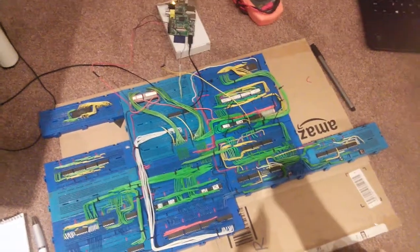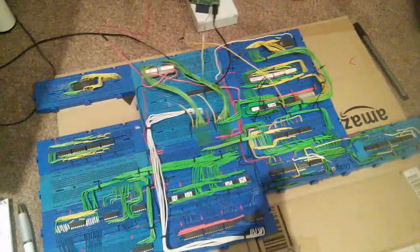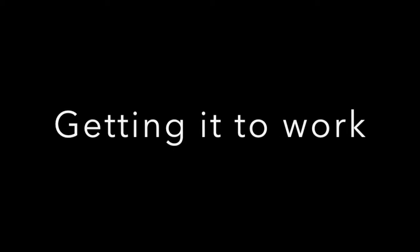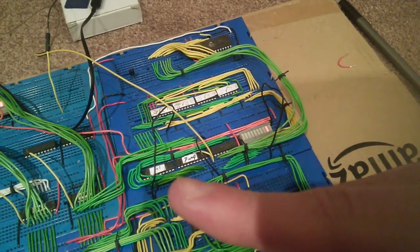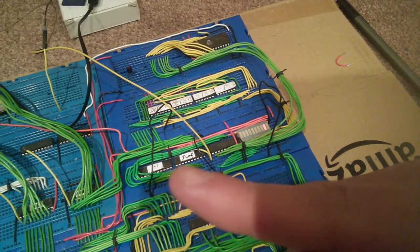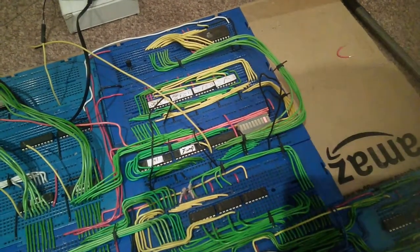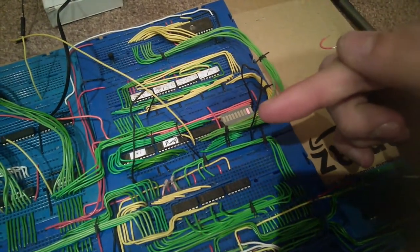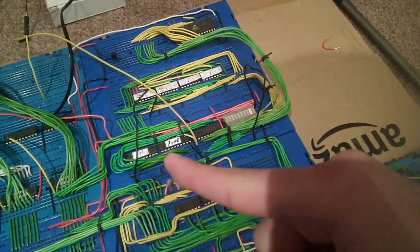This is the beast. When trying to get it to work again I encountered a few problems with this area — it is the program counter area, the component which controls what instruction runs next. There was a transistor here which decides between these two transceivers: basically, are we going to run the next instruction or jump to some arbitrary address in memory. The transceiver was burnt or something and was activating both at the same time, so for the moment everything is hardwired to the plus-one transceiver, meaning there is no way to do an arbitrary jump.